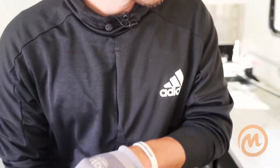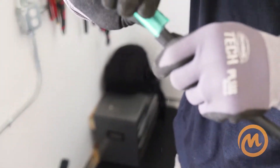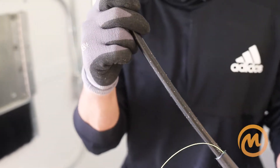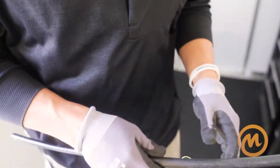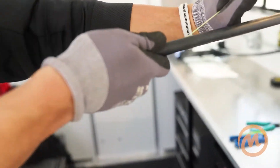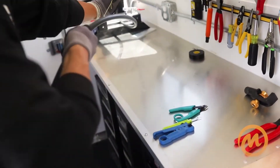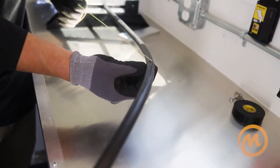That's what it looks like if you don't know what aluminum armor looks like. So then, same thing here — you're just peeling this first aluminum armor off. In this case we're dealing with double-armored cable, so we're going to go through all those steps one more time. This is your rip cord, your Kevlar rip cord. One of the main things you need to focus on is pulling with the cable — not inside, not outside, but with the cable.